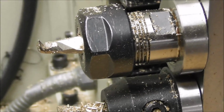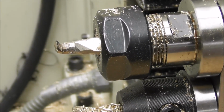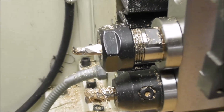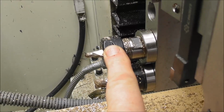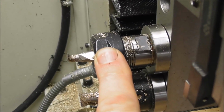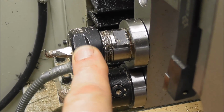And I ground that out of an old blunt 1/2" slot drill or end mill, so it was short and stiff, and just bench ground that to the right angles for a fine metric thread. So after it's roughed out the hole, it bores out and then chamfers the back inside and the front inside, and then it cuts the thread. This is all done on PathPilot's conversational programming. Very easy to build up a program, and a really good facility.